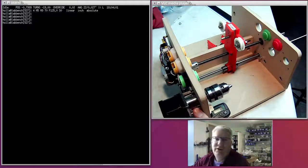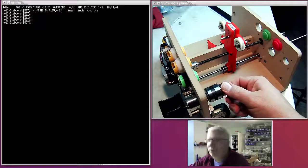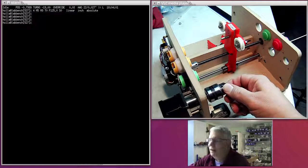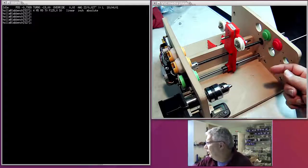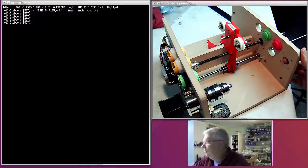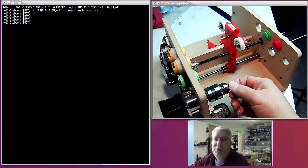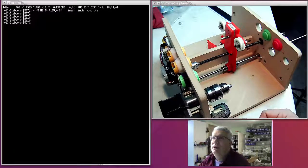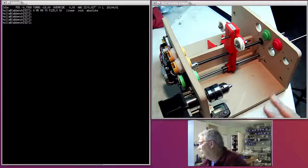This thing is also horrendously noisy. I got it on eBay and the planetary gear inside — I don't know if it's lubricated correctly or machined poorly — it really grinds a lot when running slowly. The bearing on the end has a little bit of play, which could be a problem. But if I'm winding very large bobbins I have a space here for one of those 608ZZ bearings with an 8mm shaft hole, so I can support the threaded spindle holder on both sides. That'll still work fine.